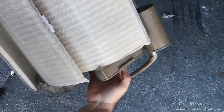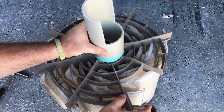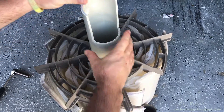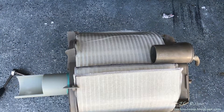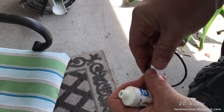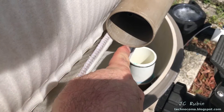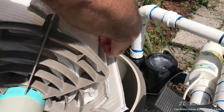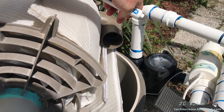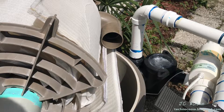I then flip it back over carefully on the manifold. I take this pipe, line up the dashes where they were previously, and lock the pipe back into position. This unit is done — it is ready for installation. I prepared the O-ring with some Jax 327 multi-lube, just coating the entire ring, then pop the new O-ring into position. I'm going to put a little bit of multi-lube in this area here because the O-ring has such a long travel up that tube — I don't want it to bind or deform as I place it in, and I wouldn't be able to know that was happening during installation.